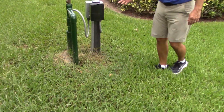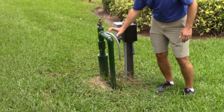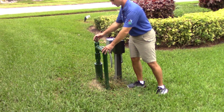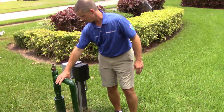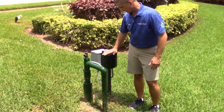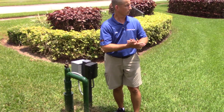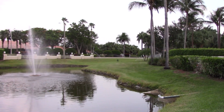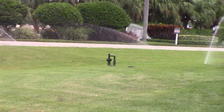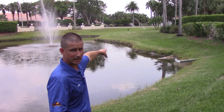Let's go take a look at the wells. This is the supply well — it was drilled with a 4-inch steel casing, and this is what the wellhead looks like after we've completed the system. We have a submersible well pump down in this hole. This is our electrical disconnect, and this pipe goes to the pool heaters to carry our source water there. All the way over there you can see that's our injection well, where after the water travels through our pool heating system and we extract some of that heat, we put it right back in the ground.